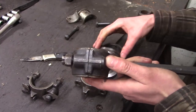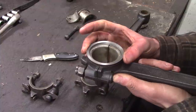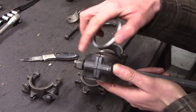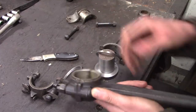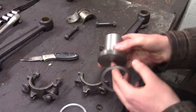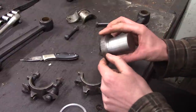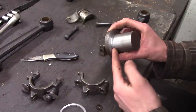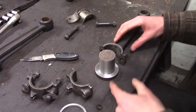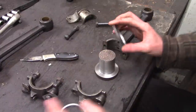Here is one proper bearing pair that he gave me to look at, so you can see there's a little stick-out of bearing on either side. What these washers are for: they're going to go like that and just be like a little well to allow the babbitt bearing material to pour up higher, rather than just pouring flush and even with this cast iron surface. That's what those washers are for — I made two of them, one for each side. The mandrel has a pretty nice smooth surface on it — the tool tip just happened to make a pretty nice radius in there — and this bottom flange is wide enough to encompass everything.